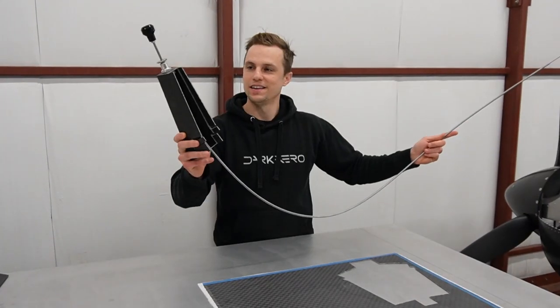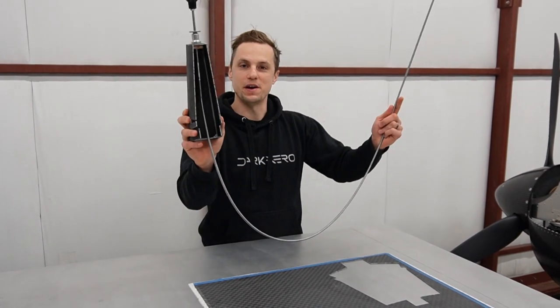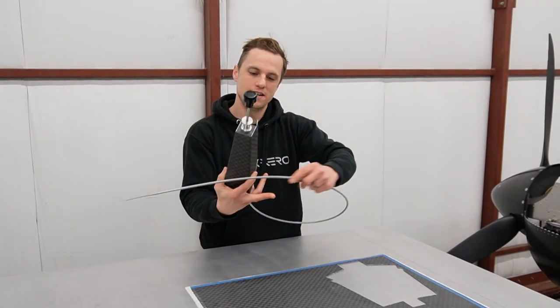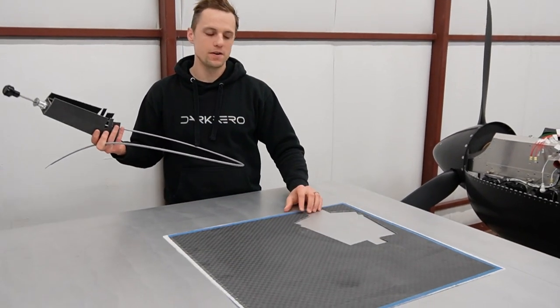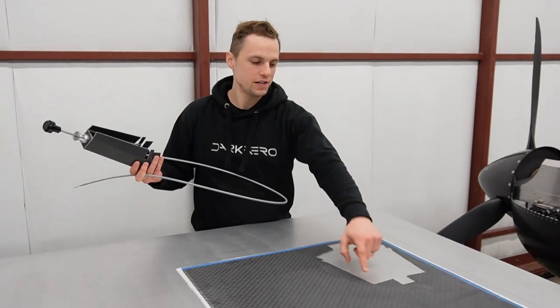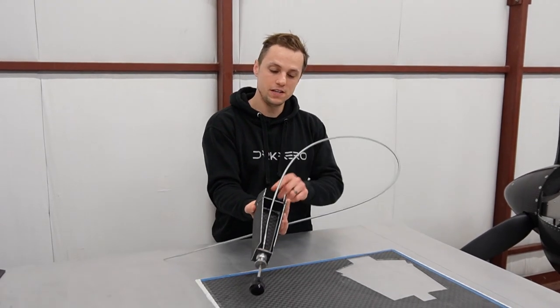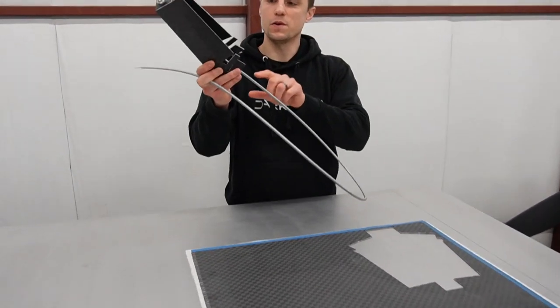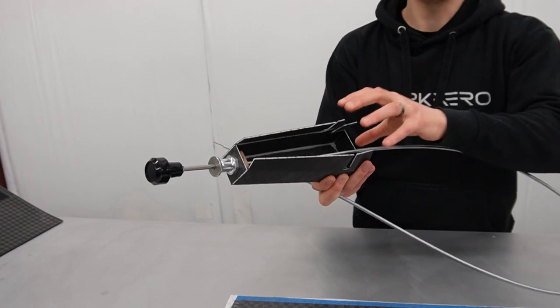I'm going to get to bonding all of this into place, but let me hand it off to Keegan who's going to talk about the exciting work going on with our throttle mechanism. I want to show you what I've been working on, which is the throttle control mount — this unit right here that I'm partway through bonding. It actually started out as a flat panel. I infused this earlier — it's carbon fiber with infusible core — infused it with resin, cured it, threw it on the router table, machined out this flat pattern, and then began to fold it kind of like origami. You can see the folds here for the sides, the back, and the front, and what's left is the fold in the top, which will create a nice rigid box structure.